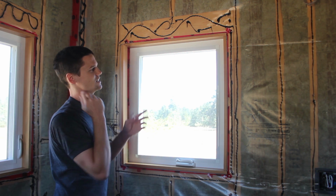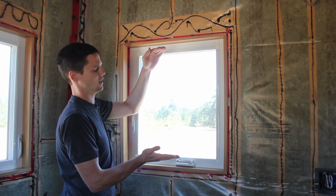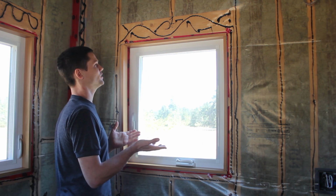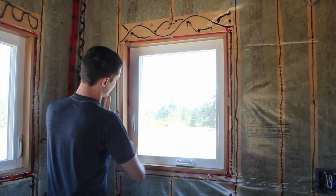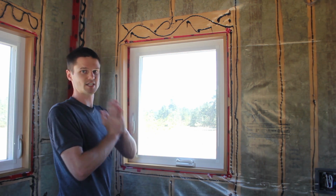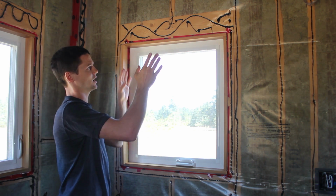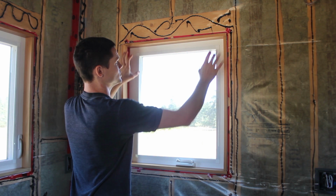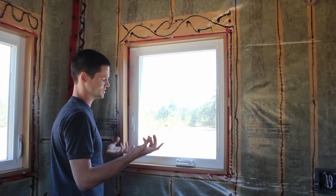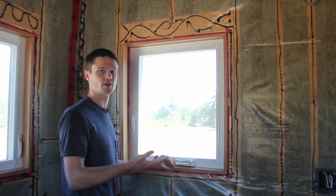So this sill gasket is actually a bit of a cheat, where it's constantly pushing back to close up any gap. So I just have to wedge it in and work it in, but those seams will have the pressure against them to keep them tight, and there won't be any play, and I won't be fighting the pieces when I'm trying to position them with the nail gun and everything. It's going to work out well. And then of course the additional benefit is that there is a tiny bit of a thermal barrier.